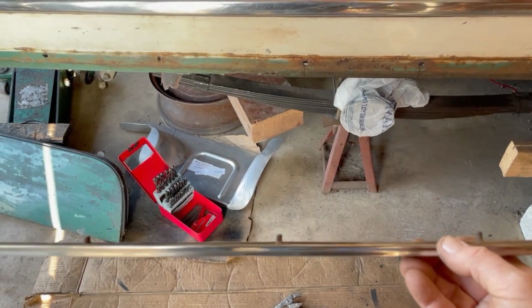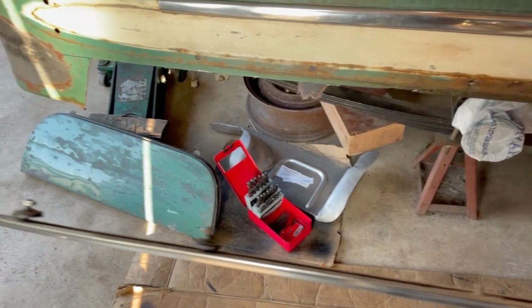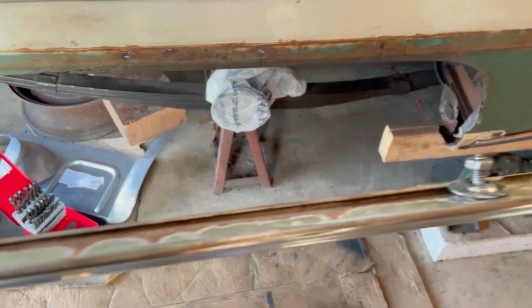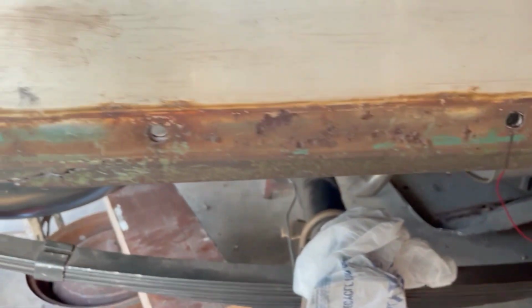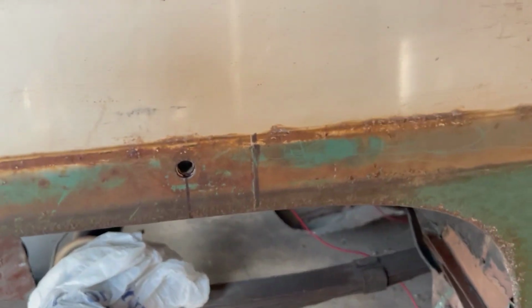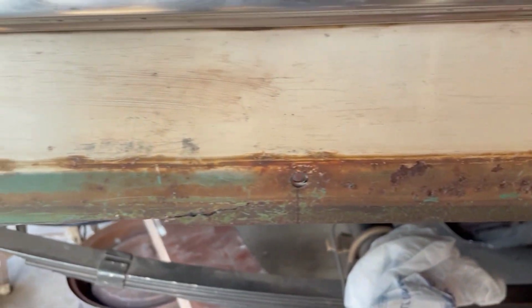And you can see where three of the bolts were cut off because they were too rusty to unbolt. So that's what tips were grabbed by the vice grips under the fender there. So you can see here too how the patch panel, we've made the holes through there to help align the trim holes. That'll allow us to translate the trim holes to the new panel from the inner piece once we take off the outer panel.